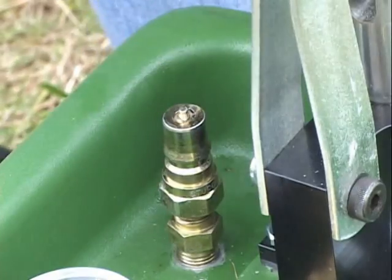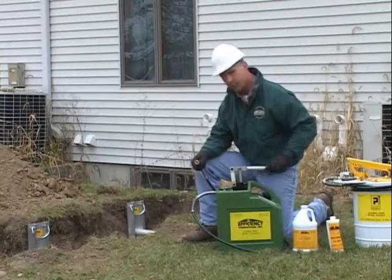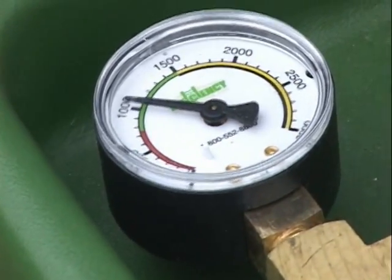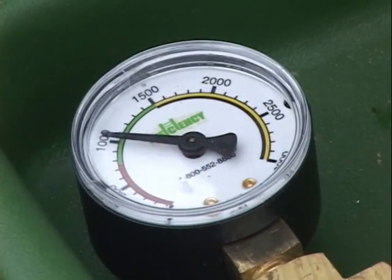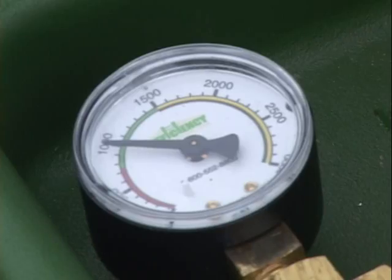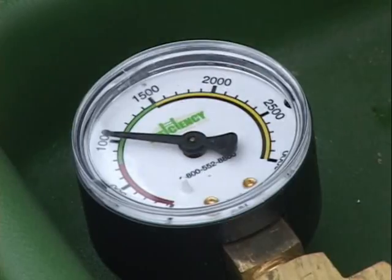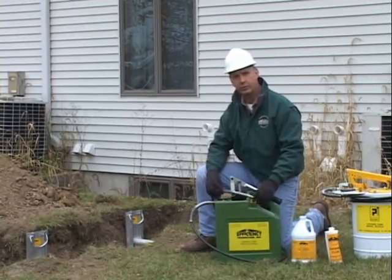Release the quick coupler. Turn the quarter turn valve counterclockwise. Stroke the can two times or until the gauge reads between 750 and 1,500 pounds. Allow the gauge to stabilize — this is done at 1,000 pounds. Wait 10 to 15 seconds. This can is stabilized at 1,000 pounds, so release the pressure and this can is ready to put into service.